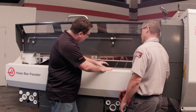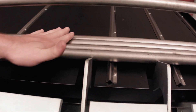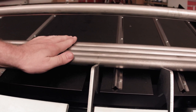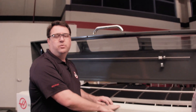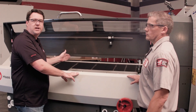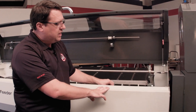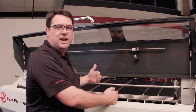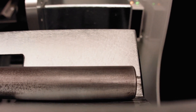Another feature I really like are these stainless steel rails that allow the material to slide down nice and easy and ensure we always get a pickup and transfer. One of the things we can still do with this Haas bar feeder is load random length bars, because with this optical sensor that measures each bar that comes by, you can load in random lengths knowing that the machine will measure the bar as it goes in.